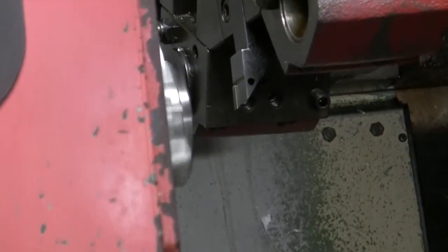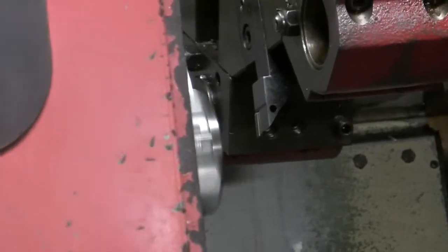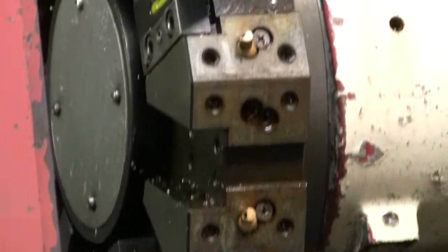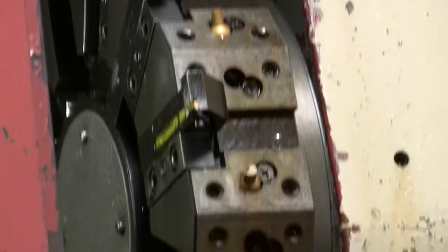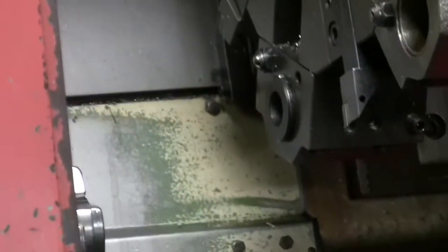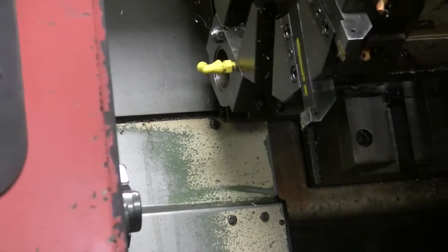We're making a good-looking thread because the nut wouldn't go on. We're doing an undercut on the back because I've just done a thread over and then part that off where I can't put it on the back side. We should leave the thread run-out around here.